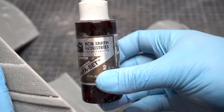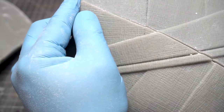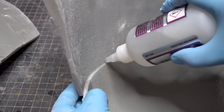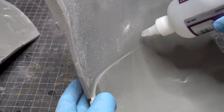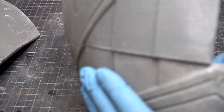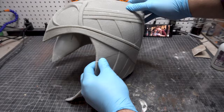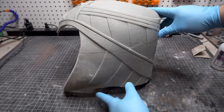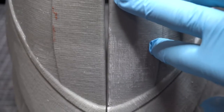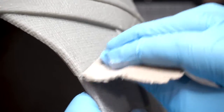Now we're going to start doing some gluing and I used Bob's Super Glue — I love that stuff — with this accelerator. It helps set it fast so I get things lined up as best I can. I give everything a little squirt and then hit the back part. It's easier to do it in two parts so you're not trying to make all the lines line up perfectly right off the bat, and they're not going to because some things shift due to printer tolerances, but we're going to fix that later.